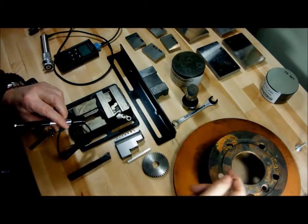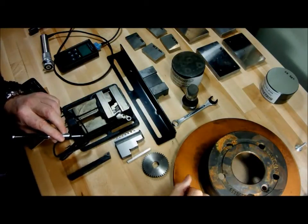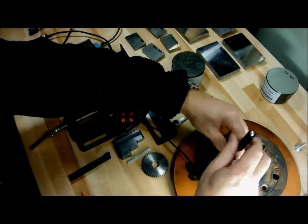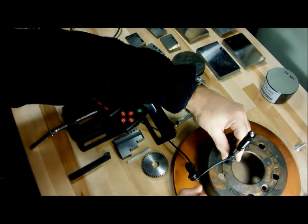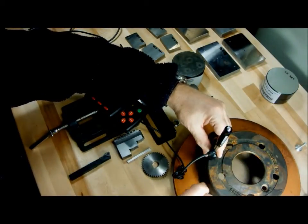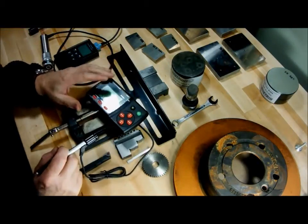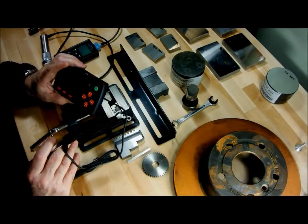For example, on this part the wall thickness is maybe three-eighths of an inch thick, even though the part weighs about 15 pounds. If I test over this area you will even hear the part ring — it's like a dull clonk and it does not give us an accurate reading. If I go over here, which is now over the area supported by the diameter, it will give us an accurate reading. So thinner parts — no good unless they are well supported.